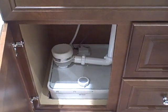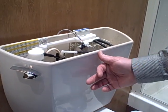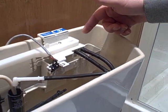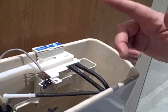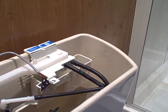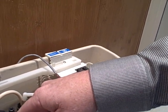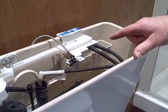You explained something to me. We've shown this before, where we're collecting the waste from the sink in the tank and then pumping it into the toilet. But I never understood the intricacies of the toilet before, how you've had to modify the toilet, even how you get the water into the toilet. We take a standard type toilet that has a regular flush valve and a float, and we add a component called the fill control unit. This piece snaps onto your normal fill valve and basically acts like a seesaw. When you flush the toilet, the fill valve is raised, holding it off in the off position, so the fresh water isn't coming in. The fresh water normally comes in from the left-hand side to the fill valve, and you're pumping the water in on the right side, so that this deals with the issue of cross-contamination.